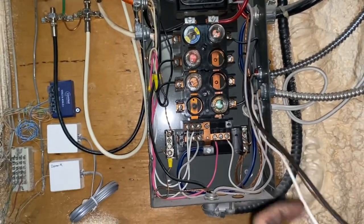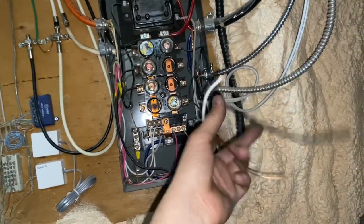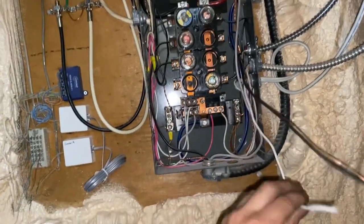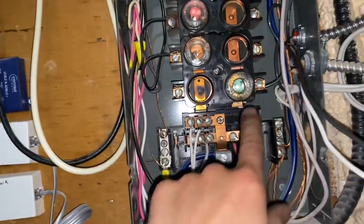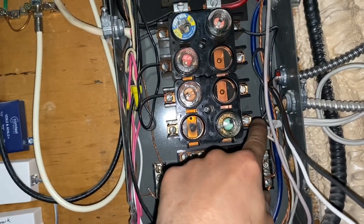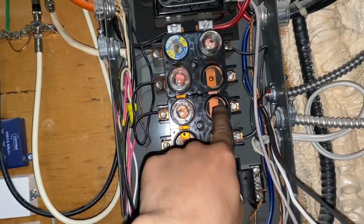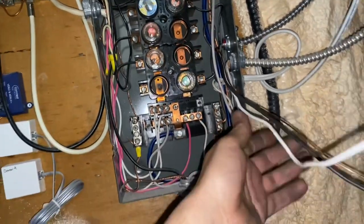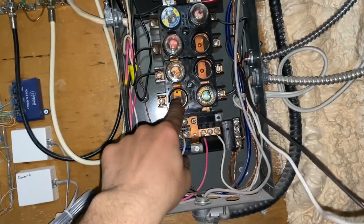What we need to do is make our new wire's white wire red and keep the black wire black. I'm going to cut these to length. One thing we have to do is make sure both hot wires land at the same vertical position on the panel. There's an existing 120-volt circuit here, so I'm going to move that fuse up and disconnect that wire, shifting it up so our two new wires can connect side by side.